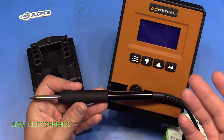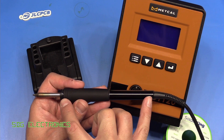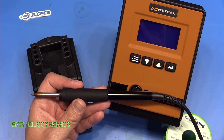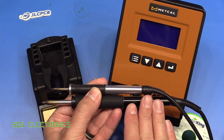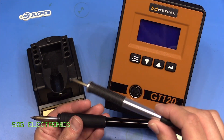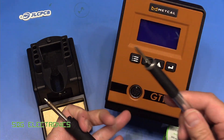In the past when I've been using the MX5200 station, which has a similarly sized handpiece, I've tended to swap for the ultra fine handpiece for prolonged surface mount soldering. You can see this one's quite a lot shorter and this makes surface mount soldering really nice and low effort because it's so lightweight and really quite small, so I looked into it.